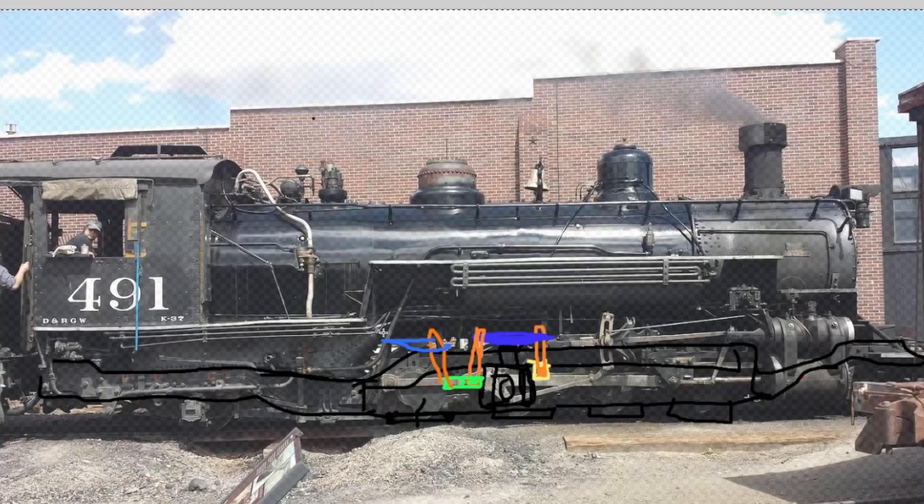The idea is: if you get to a low spot in the track, this box drops down, so does the leaf spring — it rotates, which causes the lever to pivot, which causes the next driver spring to rotate and put more moment on that chunk of frame. As you lose weight on one driver dropping into a hole, you transfer that weight to the next driver to ensure you keep traction over any bit of rough track. That's quite a neat piece of engineering. That's level six — a very crash course on running gear.